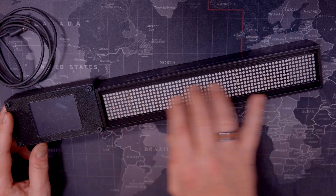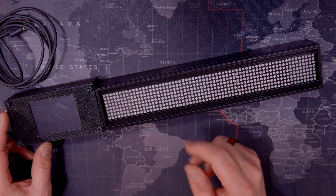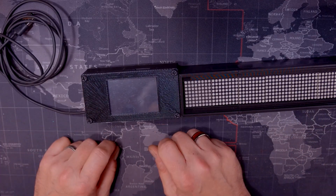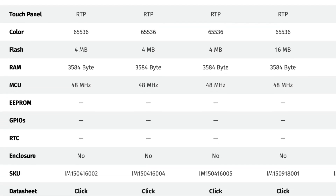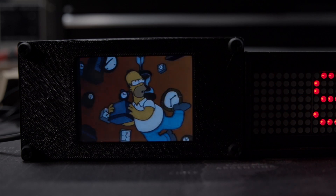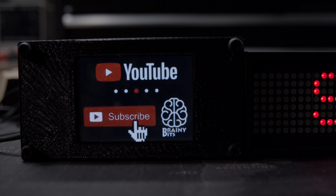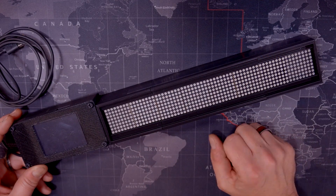All this information is displayed on the MAX7219 LED matrix — there are eight of them. I also added the Nextion display to make it more interesting. It's a cheap 2.8-inch Nextion display, and I'm using it to show animations that indicate what the numbers mean. For example, when displaying the quote of the day I have an animation of a thinking Homer Simpson, another Homer with clocks when showing the time, and a YouTube animation when showing subscribers. That makes it more vibrant and gives it some movement beyond just numbers.